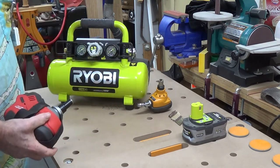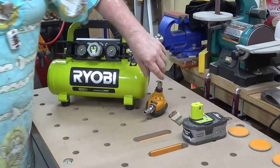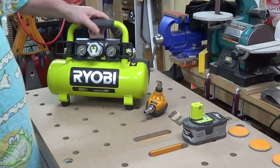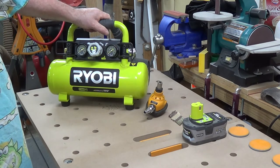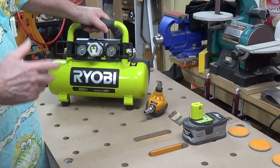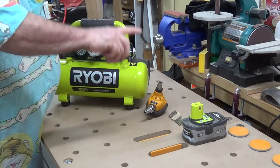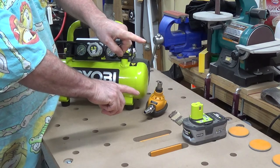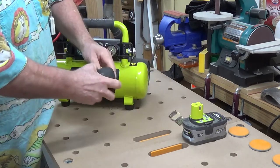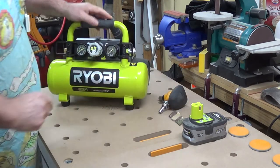All right, so let's get back to this little unit here. I thought, holy hell, will it drive this? Now, I still need this because I've got balustrades upstairs that are, God knows, about 40, 50 years old, and planks are falling off left, right and centre. I can't get the cordless nail gun in there to hammer on. I could, but it makes a dog's breakfast of it, because you've only got about that much gap to get in there. While you can drive in the nail sideways, that's going to push everything sideways. Ideally, I want to come in from the top at an angle, which this will do, and it has done.